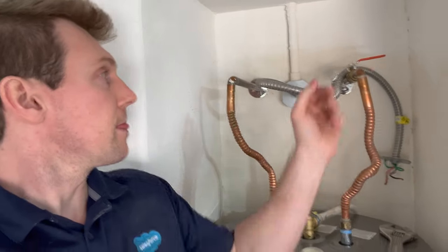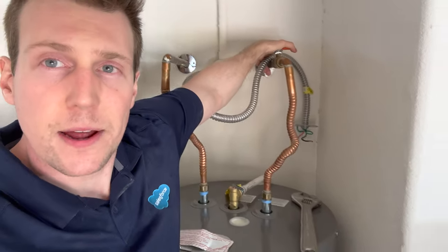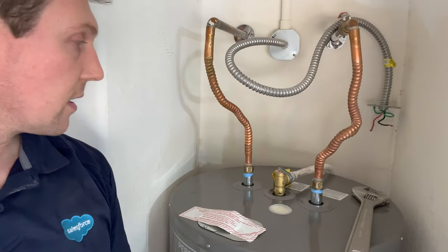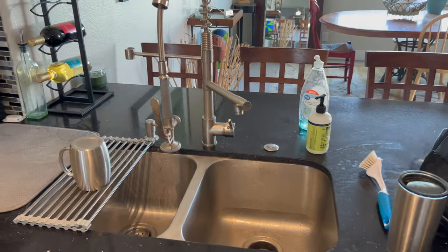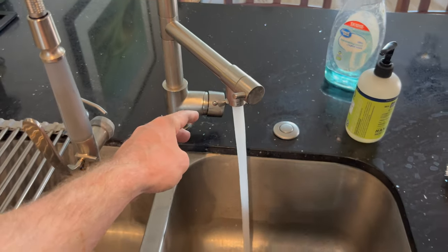Let's flip the cold water supply and fill the tank up — we have to do that before we connect the electrical. Let's flip the switch. You can hear that — water's coming in successfully. I'm not seeing any leaks, so that's good. We're going to wait for this to fill up and then perform the last step, which is connecting the electricity so that we can actually have hot water. Alright, we've got 50 gallons in the tank — it's ice cold though, so let's test the lines to make sure they are running properly. Looks perfect.